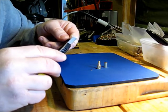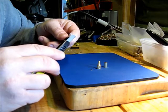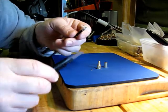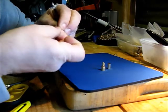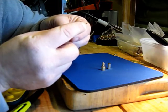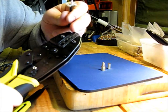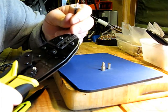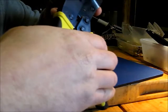First we start off by stripping the cable down to the centre core to leave approximately 3mm. The centre contact pin can then be fitted on and either soldered in place, or with the crimp tool using the smallest crimp hole — the .043 — that can be crimped in place.